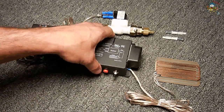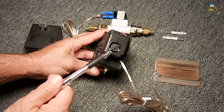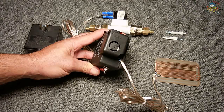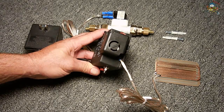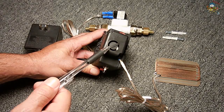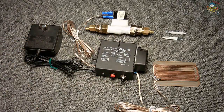The alarm is a piezo siren. I got this at Radio Shack when they were going out of business — 50% off, so I only paid $2.99. It is extremely loud, around 105 decibels, and draws around 140 milliamps. If you don't have access to a siren like this, I have another circuit on my YouTube channel you can check out via the link. The link will open in a new window — pause it and come back to finish this video first.